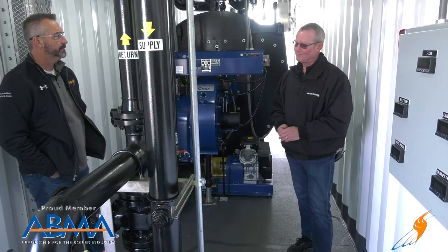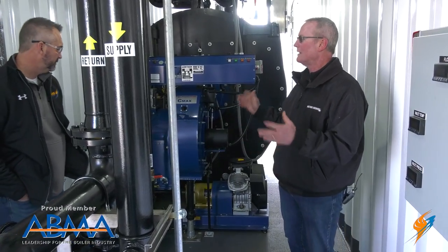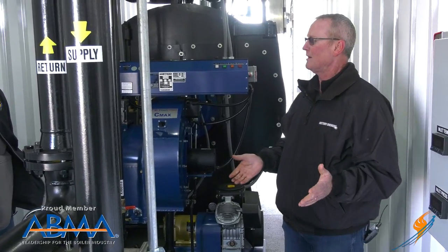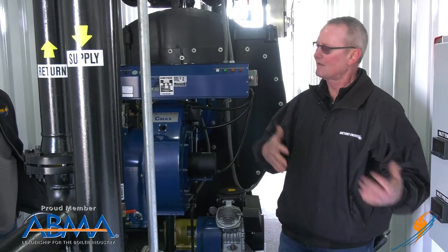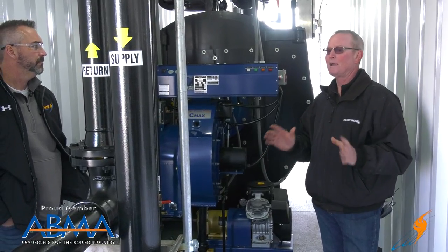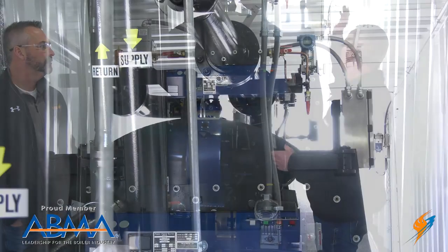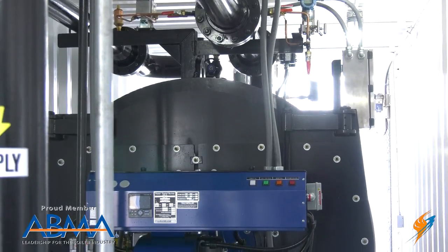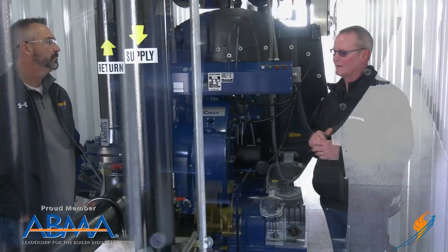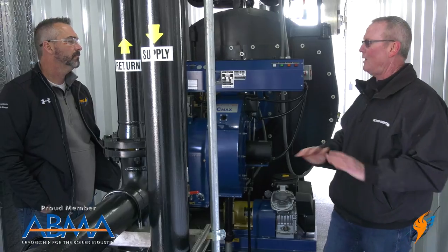I looked at that design and said that's not what you need to have. So I completely redesigned the whole thing for them, laid it out, had Brett draw it up and sent it to them. They were tickled with the new design — they just didn't know any better, that's all they'd ever seen. They said 'Hey, this works for us, copy it,' and when I gave them the new design they were like, 'That's a whole lot better.' It's going to make a really nice system for them to operate and get to — open valves, close valves, see the DP transmitters, flow transmitters, temperature transmitters — everything is accessible. Unlike having it all in enclosures, covered up — it was really a mess, like somebody just put it together and as an afterthought put panels over top of it.